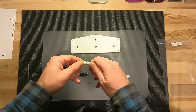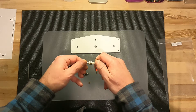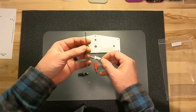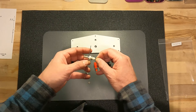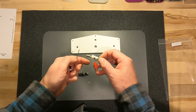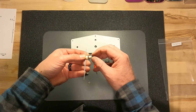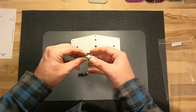You want to put these jam nuts back on — the first one locks that post into the housing. You want to snug it up pretty good. I use a little piece of 1/16th piano wire; it fits right through that hole and you can grab onto that with pliers. It's just a cleaner and easier way — you could also use a 1/16th drill bit. Then I use pliers to cinch that up tight.